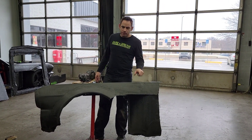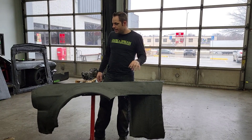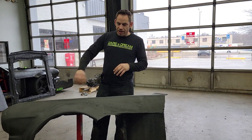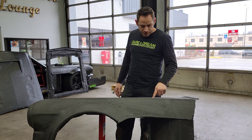First thing, we've got one more layer that we needed to get on this driver's side front fender. We just sanded it down. Next thing we'll do is wipe it down, get it clean, spray our adhesive Super 77 on it, put the last layer down, and we're going to go ahead and epoxy this one.